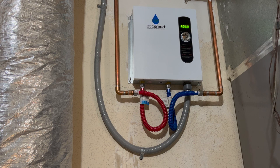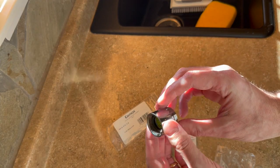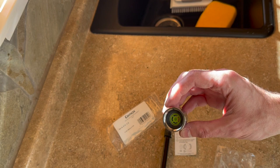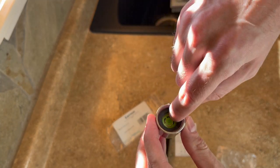First, let's talk about the issue. The E5 error code means that for the given input temperature, the water heater isn't able to keep up with the flow of water coming through your system. This could mean you end up with a bathtub full of lukewarm water. The flow regulator will cap how much water can flow through your water heater, which might mean you can't fill your bathtub as quickly, but it'll avoid the lukewarm water situation.